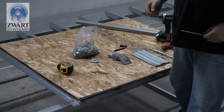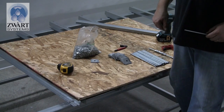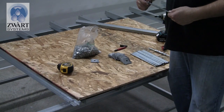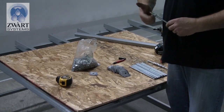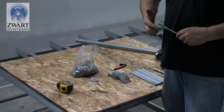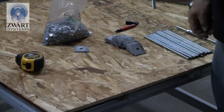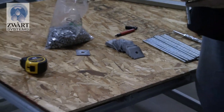We like to see about two inches per fifty feet, but it can be a little more aggressive if you like. In this bench we've decided to go a quarter inch total. To get the threaded rod ready, put the first bolt on — you need to account for the two-inch post bar and still get a nut on top. So I've set a mark at two and a quarter inches: that's the height the rod needs to be so the two-by-two slides over and I can secure it with a nut on top.